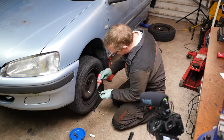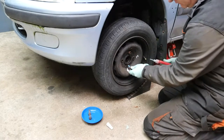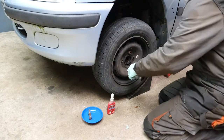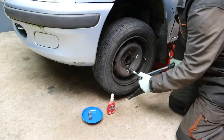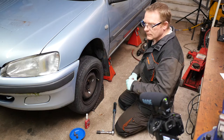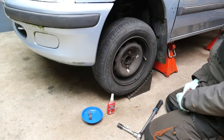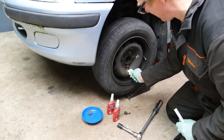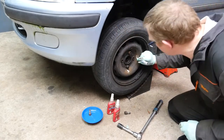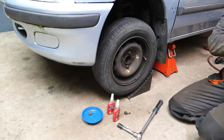Bolt two is 85 newton meters with blue thread lock. As you might notice, I'm putting that into the hole with the number four on — the chap in this video hasn't noticed this, which is me. So that's bolt number two which is labelled four. The penny's dropped! So now to get some sandpaper — we'll remove that number four and make that number two, and remove the number two and make that a number four. Right then, back to where we were.